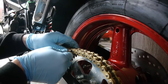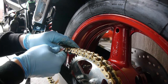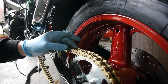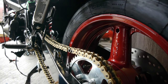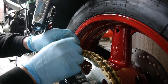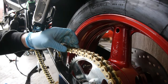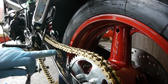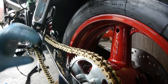Put some more grease on, then fit the two remaining o-rings and set on the plate. This is the press fit, so we're going to have to set up our little tool for that. We want to press it in to as close as we can to 22 millimeters — not too loose, and not too tight so it's binding up.